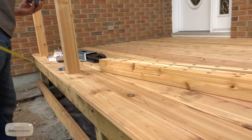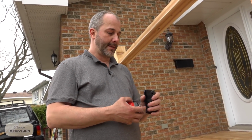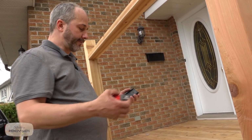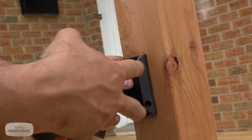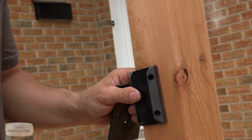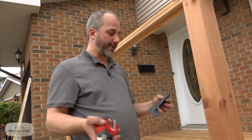Now this kit is gonna throw you for a loop because it has end caps. And these get installed on the end of the rail, top and bottom, and then you set it in place. And then they have these little places here that you can actually use to screw these into the wood so that you're not screwing through the end of the wood, you're screwing through a plate. And that'll keep your rail from breaking and rotting out over time.